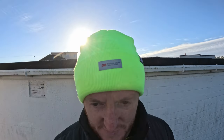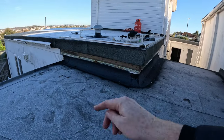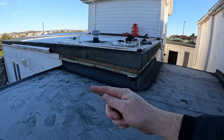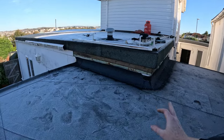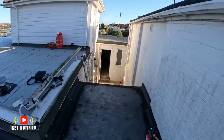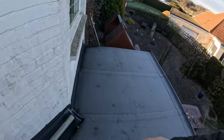It's absolutely freezing — I've got my Scan Safety thermal hat and gloves on. We're back at the warm roof project. I've just taken off the existing fascia across here, which allows for the new lead upstand to go up and down and for Ollie to get a better fixing all around to make sure it's waterproof everywhere. We've gone four inches past both sides of the roof, then we can just re-fit the fascia and gutter — job done, fully waterproof.